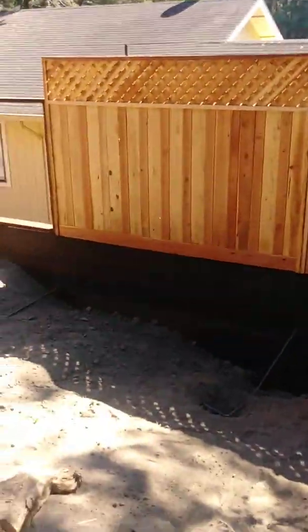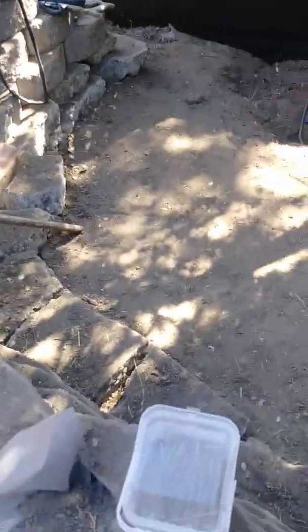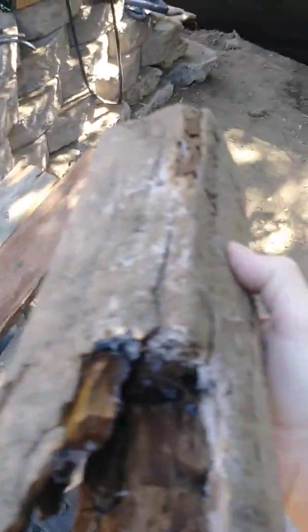The dead man anchoring system I'm using is going to eliminate any type of wood-to-ground contact. Usually people will use 4x6s or 6x6s in the ground and tie those off with another piece of wood going into the retaining wall, hoping that'll hold. But if they don't take the right precautions, over time their wood will look like this — strictly eaten away by termites and dry rot. This fence was about 12 years old.